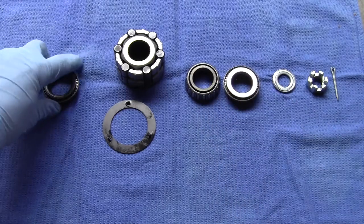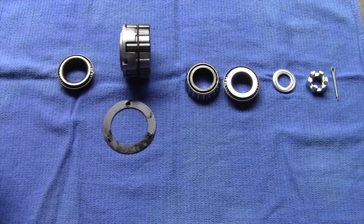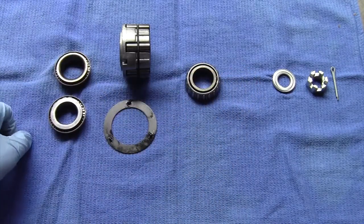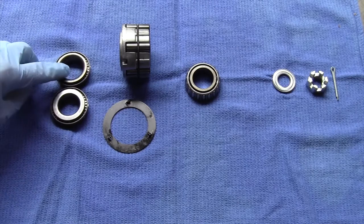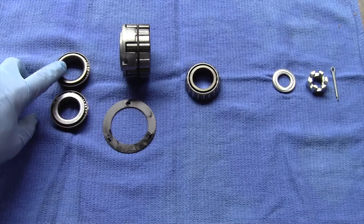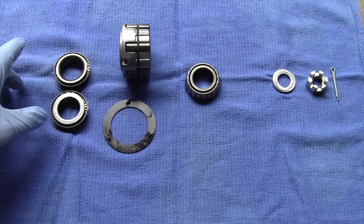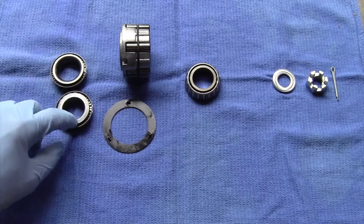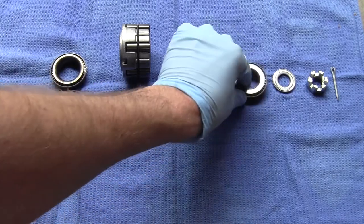The difference between these bearings and the inner bearing — the one behind the Hillard clutch assembly — if you take it all apart and you're worried about mixing up parts, you can see there's a clear difference. Look at the radius here — that big radius also has a larger ID. These are an inch; this one is about an inch and a sixteenth, or they say an inch and sixty-two and a half thousandths. That's an indicator you can look at. Also, these will not fit on the back side of the shaft beyond the spline — it's just too small — so not much chance of mixing that up if you're half paying attention.